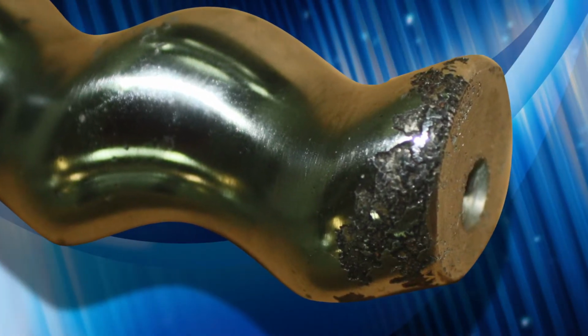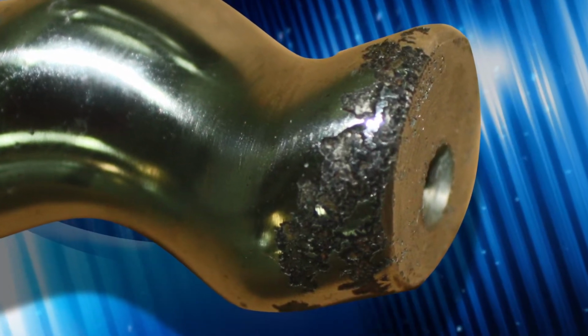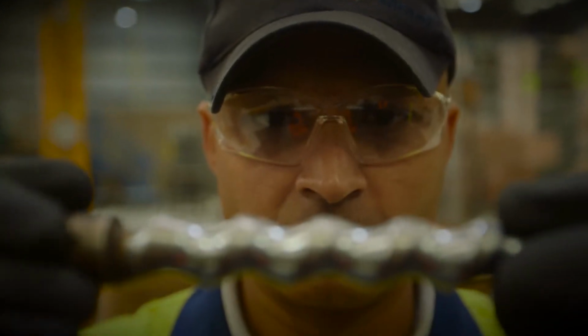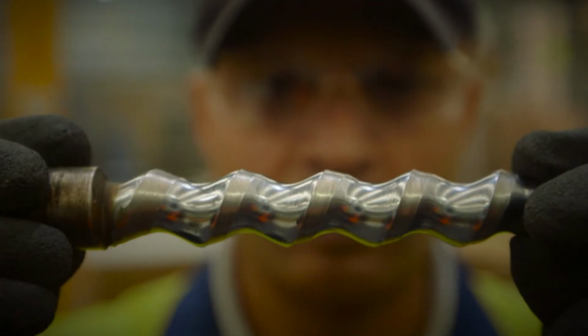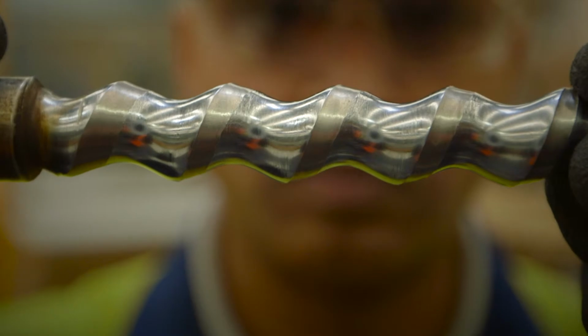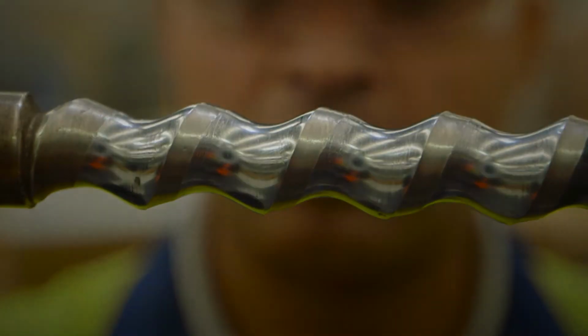Although this may not seem like severe damage, this will in a short time significantly damage the stator, reducing the pump's efficiency. Although a PC pump can sustain pumping solids, such as sand, more efficiently and over greater periods of time compared to a centrifugal pump, they will eventually wear out and need replacing. The rotor you're looking at here is from a pump that is operated in an extreme amount of sand over a very long period.